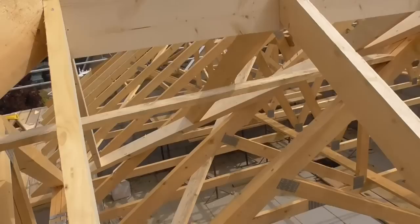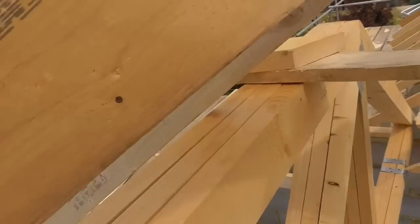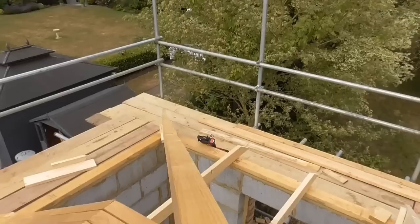And then what I've done is I've cut a piece of timber here, 65 mil. So simply all I'll do now is lay that 65 mil timber on top of that girder, look, and that will be the line of the seat cut. That'll be the line of the seat cut. So we know, I've just got to straighten it down. It's a little bit wonky, I don't know if you can see down there, look.